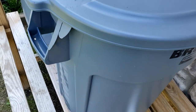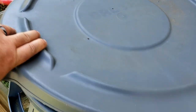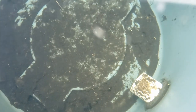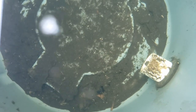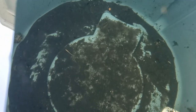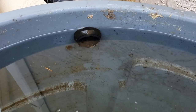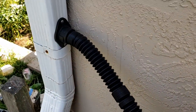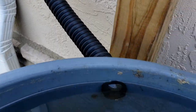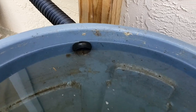This is the project we're working on today — reconnecting another barrel. Taking these tops off, you can look inside and see some trash at the bottom even though water's been collecting for a while. That's just what comes out of the gutters — leaves, maybe some shingle pieces — but there's no algae. This is where the diverter hose empties into the barrel; if set up properly it would be at just a slight angle, allowing a couple of inches at the top so it doesn't overflow.